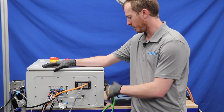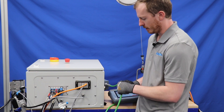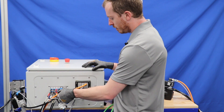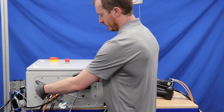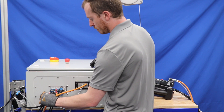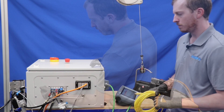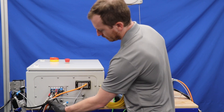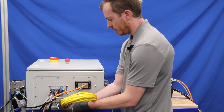On the controller, there are several cables and tubings that feed into it. The green cable is for the HMI. The orange cable is for the tool motor. The gray cable is for the tool data, and then there's the pneumatic valve bank. Note that the different pneumatic tubings have tape on them to designate which location they go into the valve bank. The optional cutoff signal and foot switch are accessible at these two points, using the four-pin yellow cable that comes with the controller.